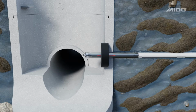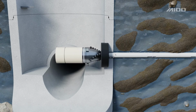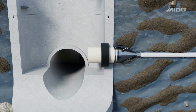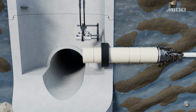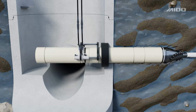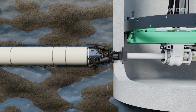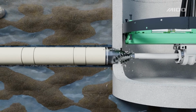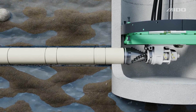The sewage system is made of modular pipes which are connected by means of a compact squeezer. The total length of modular pipes including the introducing and expanding pins is 700 mm. Longer modular pipes with a maximum length of 1 meter can be produced. The tightness of the connection of individual modules is achieved by a gasket made of NBR.